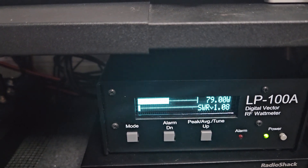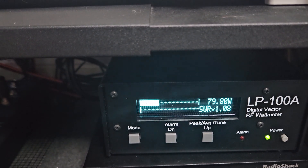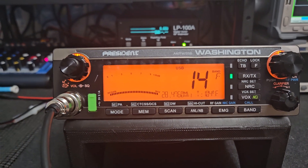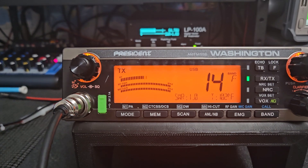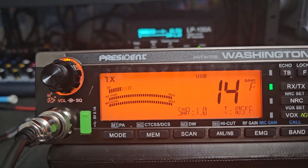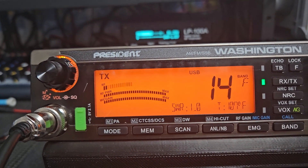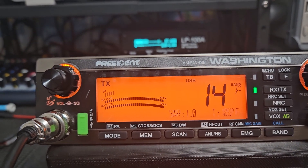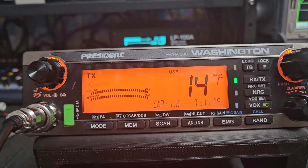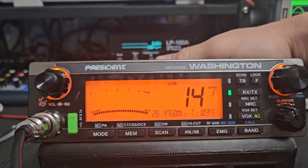If you want something running 320 or more watts then that's up to the operator. On HF we wouldn't be using AM anyway — we'd be using sideband. Generally speaking, unless your amplifier pushes you over about 350 watts it's not really going to give you much benefit — at times we're already hitting nearly 90 watts out of this. A couple hundred watts isn't going to do a whole lot for you. Guys more into amateur radio will understand this. Power is important, but so is antenna, and without the right propagation you're never going to get anywhere — it's all about the propagation.